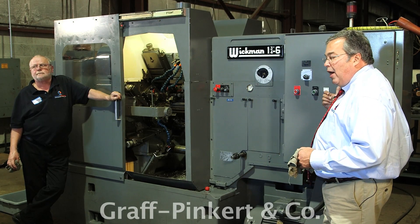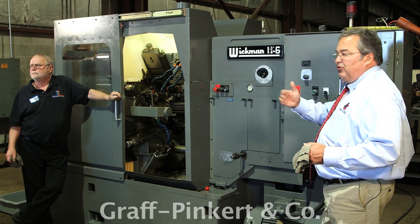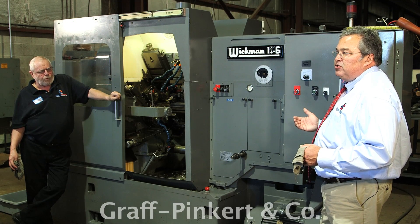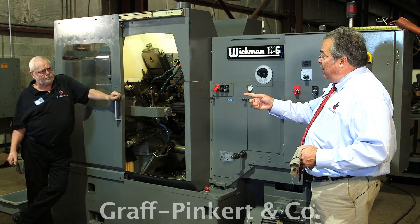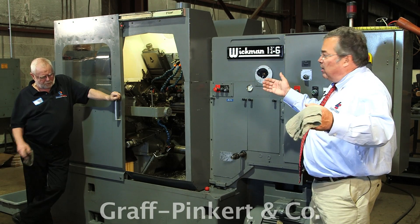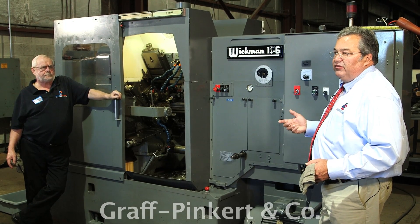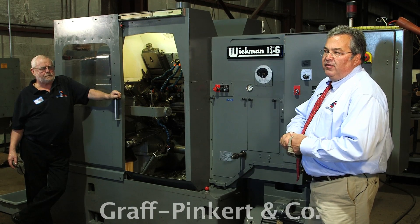It's adjustable between 1 and 99, so you could do 99 different stops and starts in one machining cycle. We have this one set to about six - so it goes on and off six times during the machining cycle. Before with the chip breaker off, the form tool was making one long ribbon that never broke off once. Now we break it off at least six times, and maybe it breaks off once or twice on its own, but we certainly break it when we stop the feed.